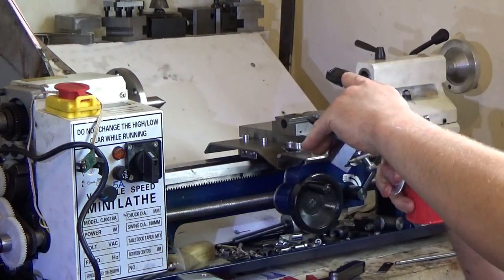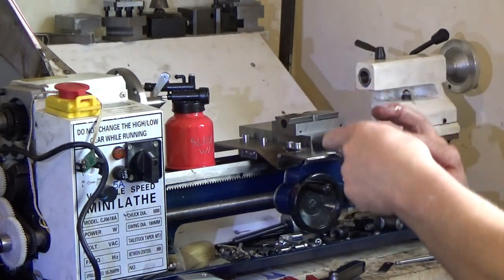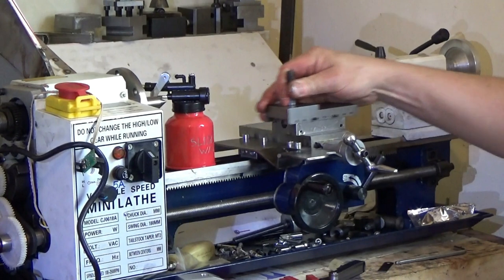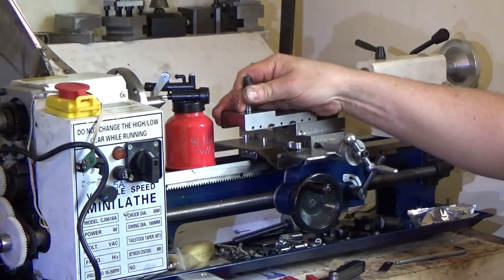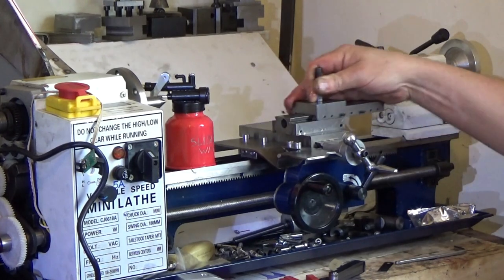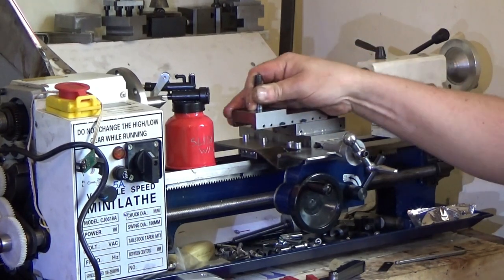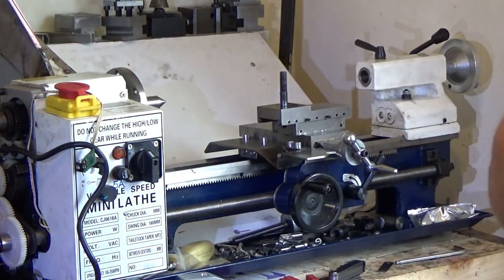Excellent. It's just not happening how you want it today. Try not to get oil all over the kitchen floor. Now it's got oil in, has it gone tighter? Yes, of course, obviously. There we go. Now it's feeling smooth. Excellent, excellent, excellent. So you just see a lot of forwards and backwards motion now. So I've got lots of slideway oil, which is allowing me to slide down the slideway instead of feeling bindy. That's all good. No more oil required. Put that back.